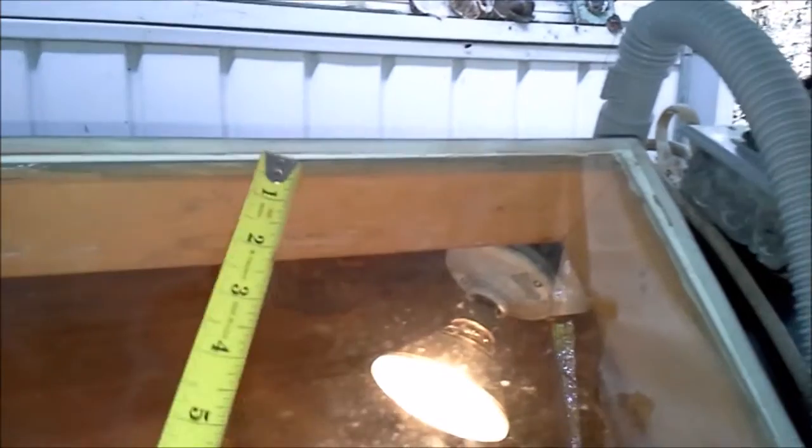And then I took caulking and ran caulking up here on the outside. And when I put the window in, I don't know if you can see this, but I kind of notched it. I notched the casing. Once I had these pieces fit, I took them out, and then I just cut a groove in them in here with my table saw, so that the glass would just fit in and it'd have like a natural place to sit.